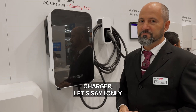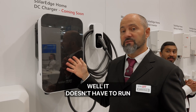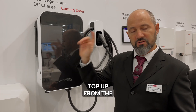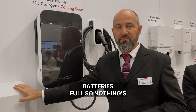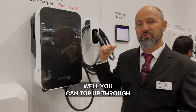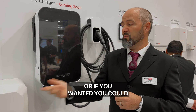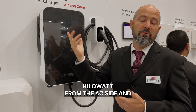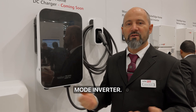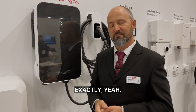If I only have 15 kilowatts of panels, how am I going to get 25 kilowatts out of that charger? It doesn't have to run at that rate — it ramps depending on what energy is available. In theory you could top up from the AC side as well. Say your batteries are full and you've got only 15 kilowatts from the roof — you can isolate the battery capacity, top up through the inverter with a 10 kilowatt single-phase inverter, getting some from the AC side and the majority from the DC side. Or you could use your batteries to output — 5 kilowatts from AC and 20 kilowatts from DC. The inverter is a multi-mode inverter, bidirectional on the DC port, able to both source and sink energy into the battery.